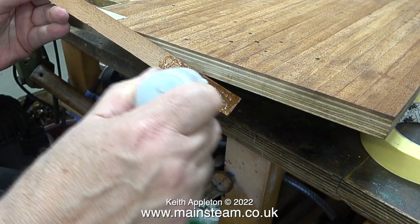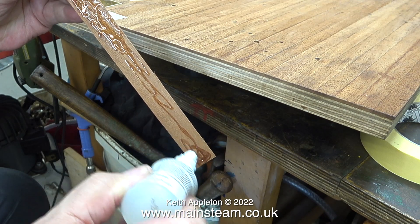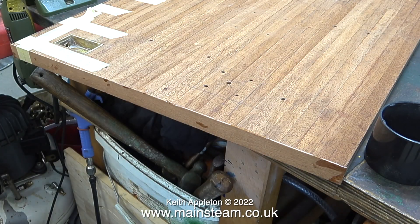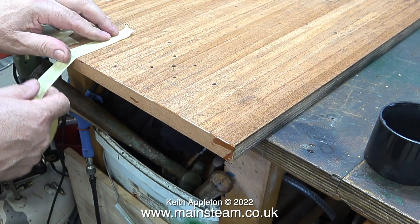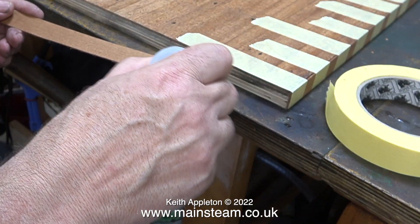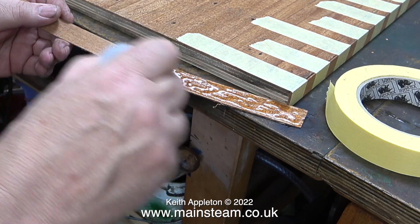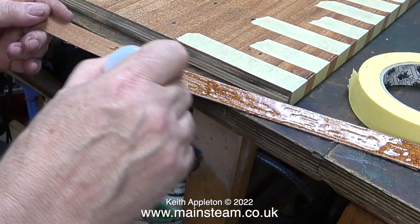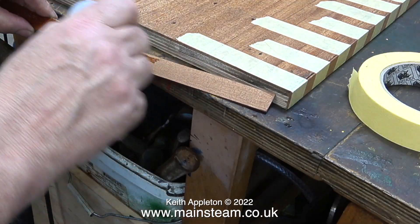I don't have to mess about with this next piece because there isn't any hole in the wood to fit to. It's just a case of thoroughly coating the piece of mahogany using the cyanoacrylate adhesive, not leaving any gaps at all. After fitting the second piece of mahogany edging in place, once again I use the masking tape method to hold the wood in place until the cyano adhesive is fully cured. I'll leave it for about 24 hours — that should be okay. I decided to speed up the process, so I left out fitting one of the sides — I did fit it but didn't bother showing it. One more time, I'm using copious amounts of cyanoacrylate adhesive to make sure this piece of mahogany becomes permanently connected to the side of the baseboard.